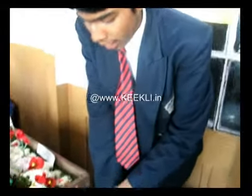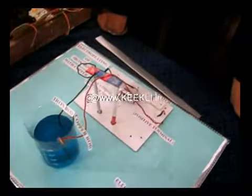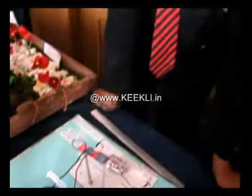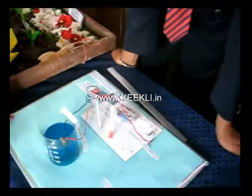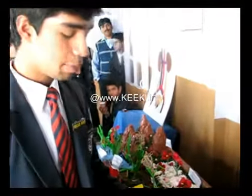This is the electroplating of an iron rod and a copper rod. Electroplating is a process in which a thin layer of metal, like gold, silver, or copper, is deposited over another metal. In this process, direct current is used — AC current cannot be used. If AC current is used instead of DC current, the deposition will be uneven.